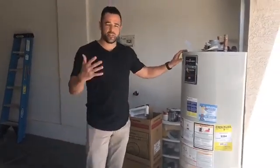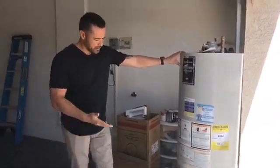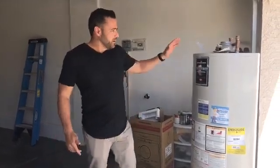How's it going everybody, thanks for joining us today. Originally we came out to this call because there was yellow water coming out of the faucets on the hot side. The first thing we go to is the hot water heater. This tanked water heater is about four to five years old with one year left on the warranty. We went over the features and benefits of going tankless with the customer, and they decided to go tankless. Yellow water coming out of the hot side is a good indication that this water heater is failing.